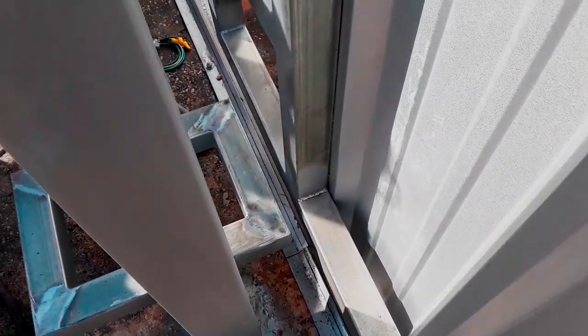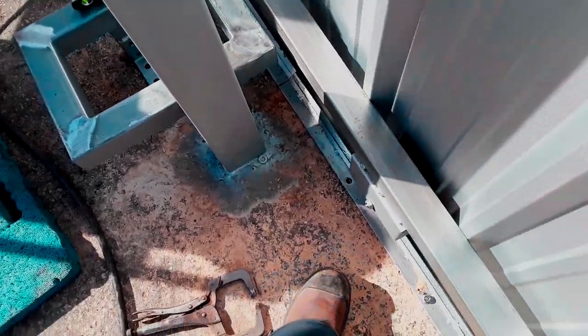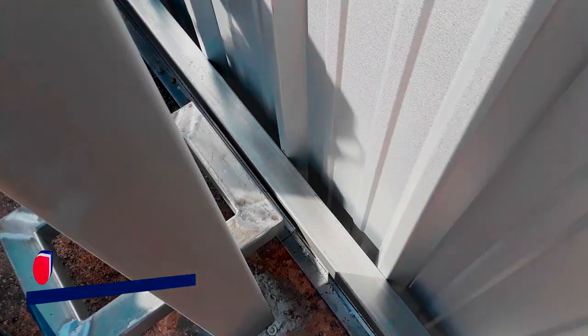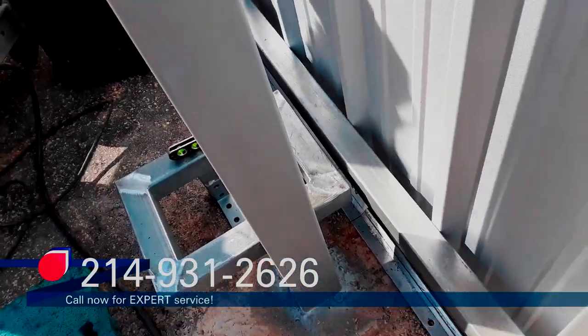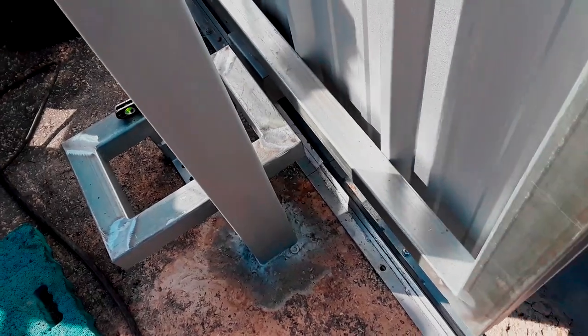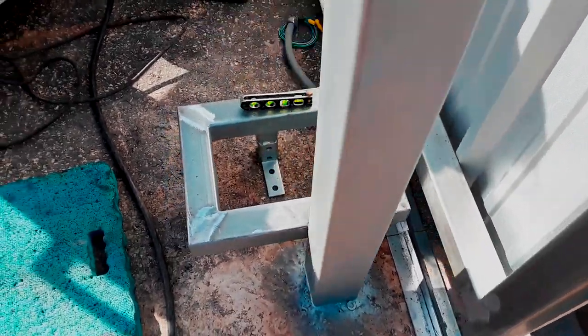You can see we got a little bit of bow - there's an inch and a half there and some spots over here that are a half inch right there. That's why you want to double-check your clearances and make sure you've got plenty of room. It comes back out to about an inch and a quarter right there, so that is really good.